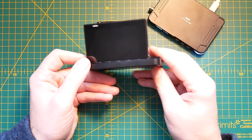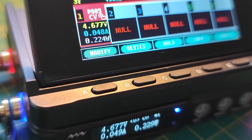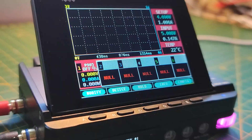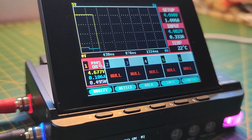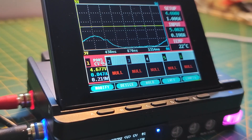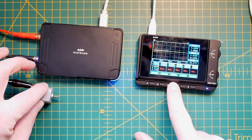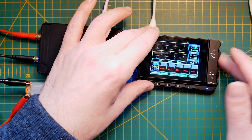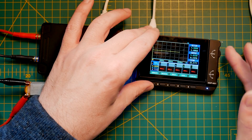The control unit is powered by micro USB. I'm a little upset it's not USB Type-C but it is what it is. You'll notice a big screen that is used to select different menus and operate different channels. It will also display a graph of your power curve usage so you'll be able to monitor the voltage and current use of whatever device is connected to each channel. It's very handy especially since you can change the timescale and see what's actually happening. You can select which channel you want to operate and that way control multiple power delivery units across your stack.